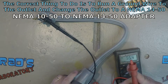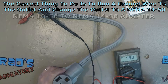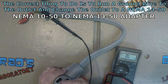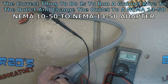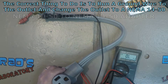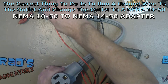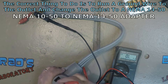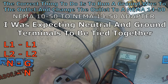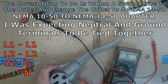So that should be one of the... ohms. That is that one there. 75 ohms. And then this one should be this one here. Yep. So what's going on with this middle prong that should be neutral? It's not there — you tied it to ground. So nothing on neutral, and only ground. Interesting.